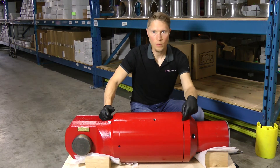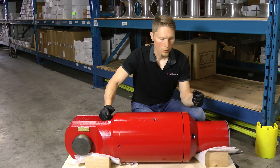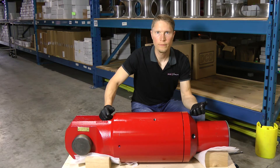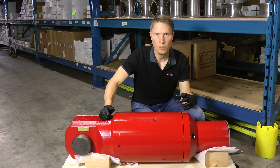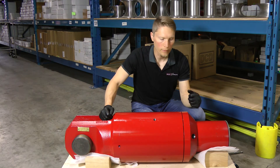If you get grease coming out of the split line, that means you've flipped your seal and now it's not good. Stop there — don't use the swivel. That seal cover needs to come off, the seal needs to be inspected, make sure it's not kinked or damaged, and reinstalled properly. Seal cover goes back on before you go any further.